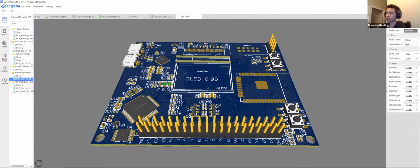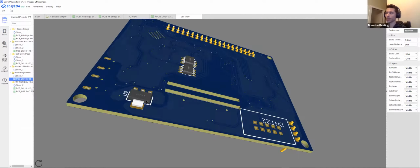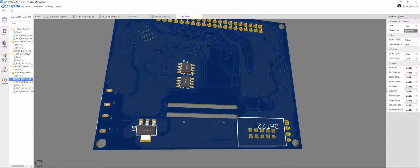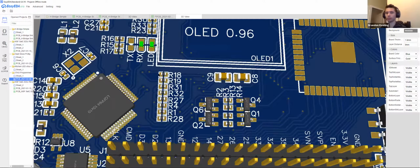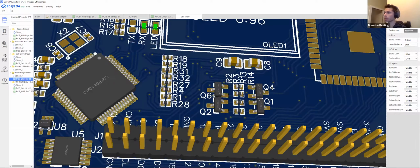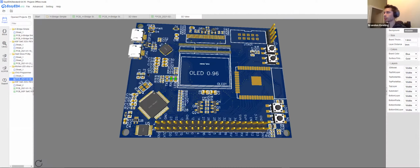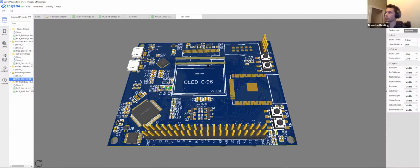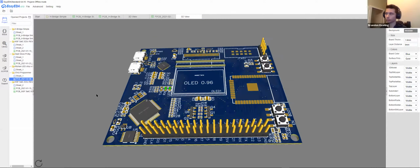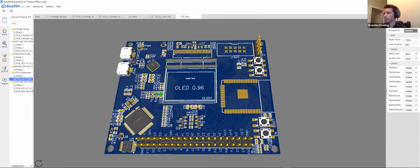And again, the parts are going to be really important. Like these two are pretty affordable, which is why I put these guys on the back, because I'll have no trouble soldering something with pads this size. Whereas all of these tiny little components are under 1 millimeter long. So yeah, expensive parts are what's going to really drive your price up. It's not the part count. They won't charge you much. If I just got rid of this one chip, it would cut the whole thing down by a ton. So how much you want to pay is really just indicative of how important the project is to you. It's not absolutely everything, but it's concept to PCB.